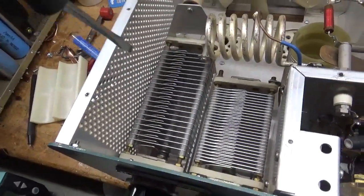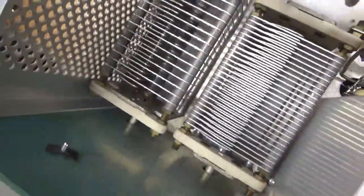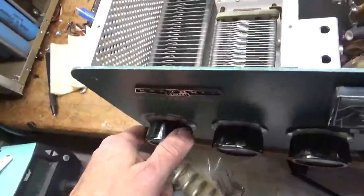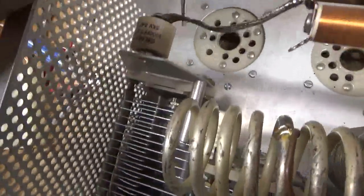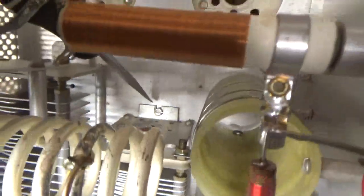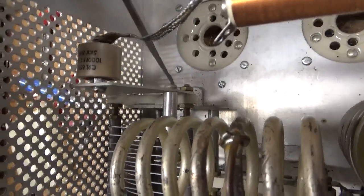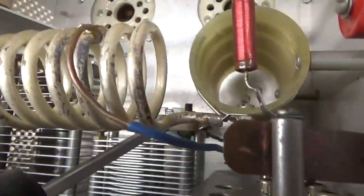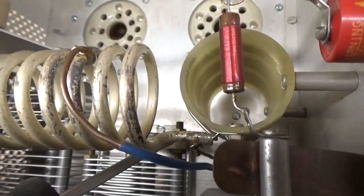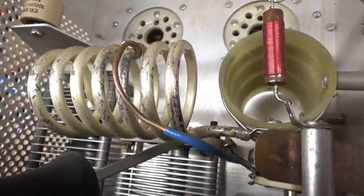On the air variable on the plate tuned side, it had washers underneath - that's a bad idea, they're steel - and it wasn't even lined up in the middle of the hole anyway. It's not worth it to try to line it up in the middle of the hole if it doesn't end up binding, so there's no reason to do that. Took those out, tightened up real tight, put cap nuts on the other side. On the load air variable capacitor, had a washer on top of the screw that was loose - got rid of the washer, tightened it real tight. I ended up putting internal tooth crush washers - lock washers underneath the nuts on the back here of this plate. I also loosened the nut over here on the load side - the spade terminal was right up against the ceramic, so I put a nut there, then an internal tooth crush washer, and then the brass nut over that. Now it's super tight.